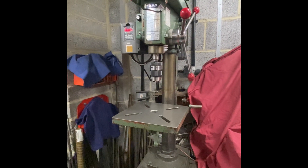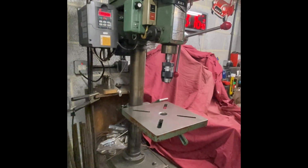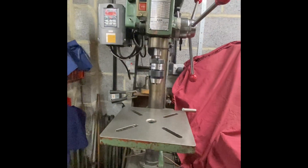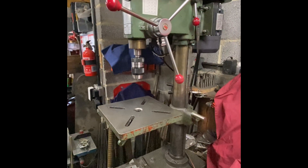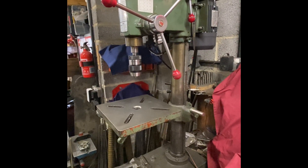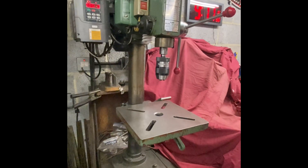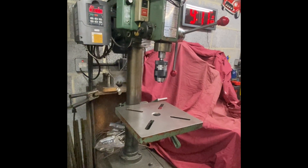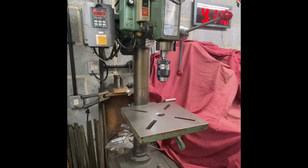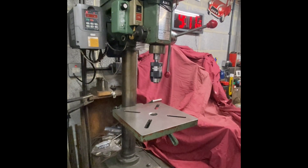This is my Ajax B16L Bench Mounted Pillar Drill. I've had this quite a while and basically inherited it off my dad. I've installed it on the end of my workbench. It's not quite standard and there's a few extra modifications which we'll go through. I use it for general purpose drilling, whether it be drilling extra holes through cylinder heads for the 11 stud conversions, or even for valve seat roughing out. It's got a little bit of run out on the spindle, but nothing major, and it's perfectly usable for general purpose drilling. The other thing I use it for is recurving of distributors — spinning up distributors to verify the advance curve and the modifications I do to them.